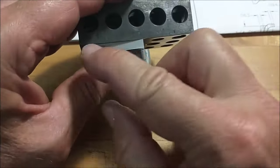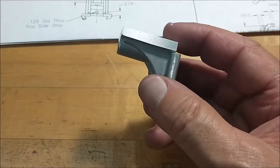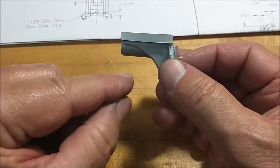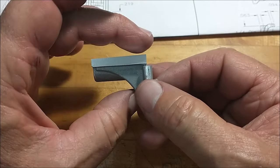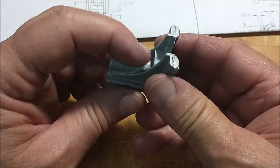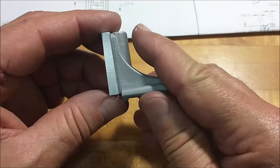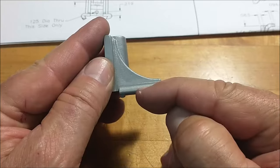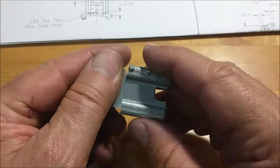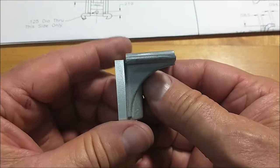I will go with the outside square relationship over any other feature at this point. Now that means that the 500 here is going to be out along the length of this bottom component right here. If I were to bring that in parallel, there would be a backdraft here. This would no longer be square because this is not a machined surface. So it's 50-50, dealer's choice.